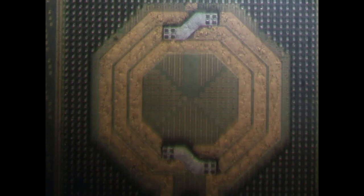If we zoom into the inductor, these are fabricated out of two metal layers and a bunch of vias. You need inductors to do things like mixers, oscillators, and impedance matching. The cleverness here is all done through photolithography, so these inductors are dirt cheap, other than the large amount of silicon die they occupy. You can see here in the silver component a bit of trace on a different layer. These little boxes are vias which connect the metal layers together, and what you have here is a classic inductor.